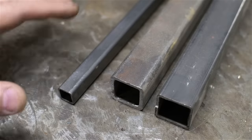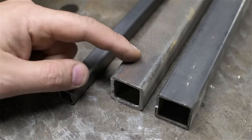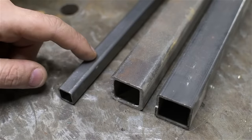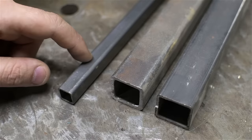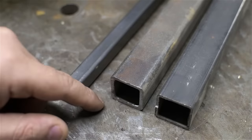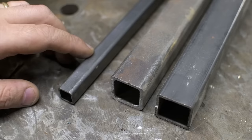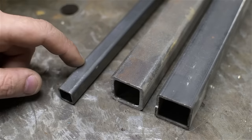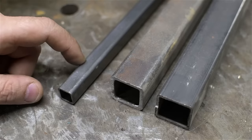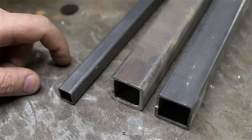As far as tubing goes, I've got a fair amount of 5/8-inch 60-thou-wall and some inch or inch-and-an-eighth in heavy and thin wall. The problem is I have more of the bigger stuff but it's in shorter pieces. I have enough of the small stuff in longer sections that I think it might be easier to use and bend rather than weld up a lot of shorter pieces. A 3/4-inch or 19–20mm light section square tube would have probably been ideal, but I'm working with what I've got. Using the smaller stuff means I'll have to go with more of a space frame — 3D trusses, a little more complicated. I also need to make a die for the bender for this size tubing.